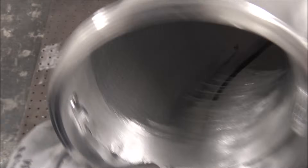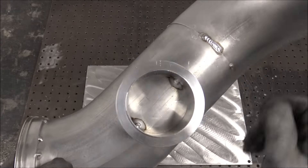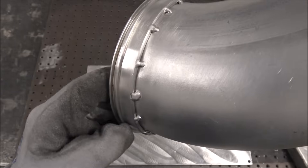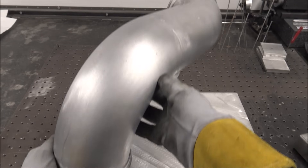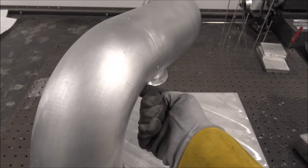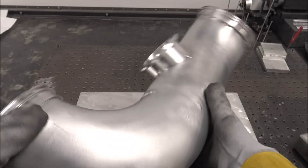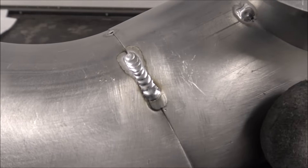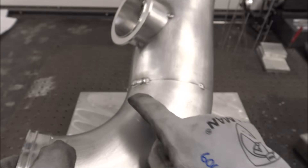Now I've got everything pinned down on the inside so I can grind all this off and put a nice smooth fillet weld around everything without having to bump over these tacks. Some quick advice about focal points — this goes on the car like this, so you want your weld stops to be underneath here, back here, and down here so you don't see them on the finished product. I've put a little test weld on here to see how clean the part is.